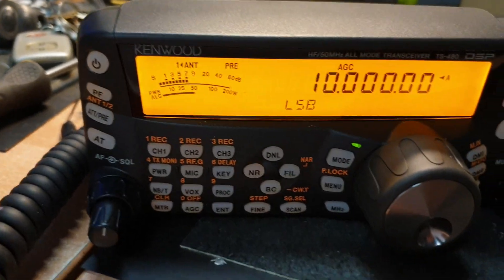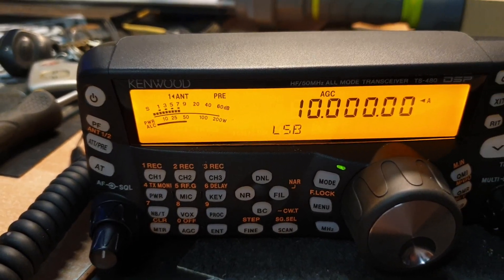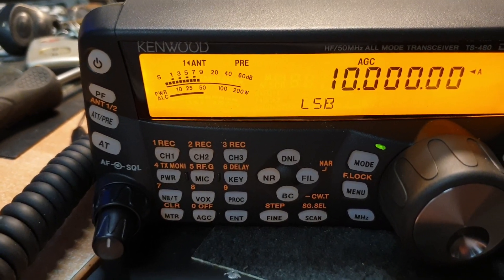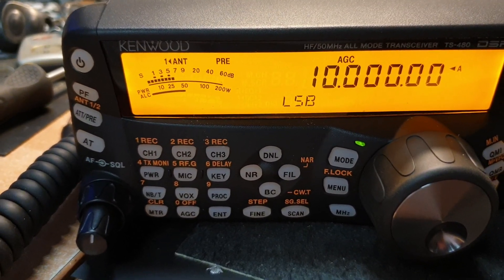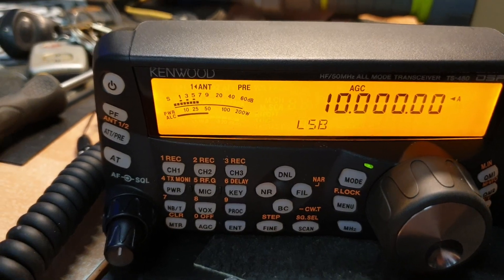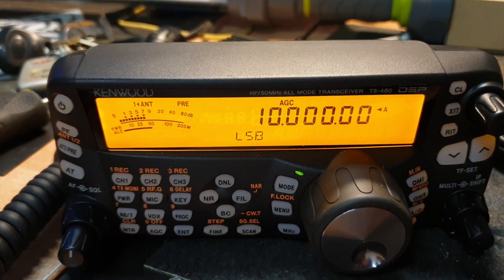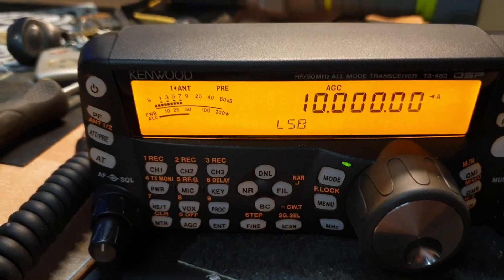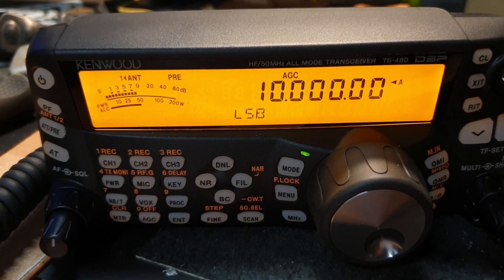I've put a few of these in before. The booklet says to go to WWV at 15 or 10 MHz. It's very rare that the SO3 crystal oven actually needs to be calibrated — that's just been our experience. Having fitted probably 15 or 20 of them over the years, they just seem to go in beautifully and you don't end up having to sit there playing with the oven at all. I'm just waiting for the right beep — isn't it amazing how long 60 seconds takes?